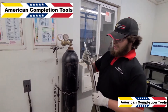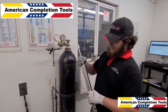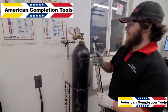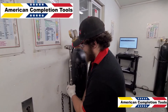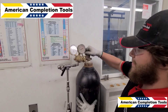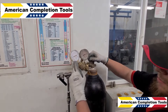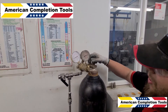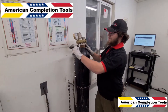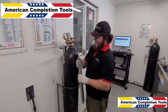I will attach the charging adapter, making sure that the O-ring seats properly into the valve, then attach it to the tank and add air to the valve. You can see the pressure come up, the valve opened, took the extra charge, and we shut off the air, then bled off the excess nitrogen and removed the charging adapter.